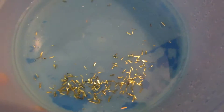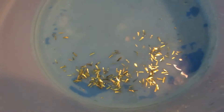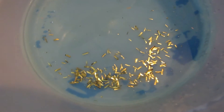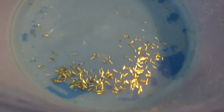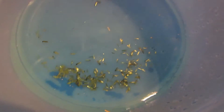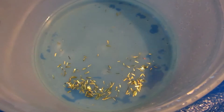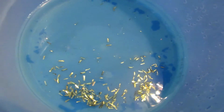As you can see in this bucket, there are all our gold foils. I went ahead and diluted the acid in this water then removed all of the little circuit boards. Any that still had gold on them I saved for reprocessing in a future batch — there were only two like that, so pretty good results. This is most of the gold from the one CPU we took apart. Now we have to filter it off, and I'm thinking of spraying the foils down to the center of a coffee filter so they form a little blob, then we'll try to melt them down in a carbon crucible in my arc furnace.